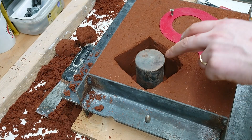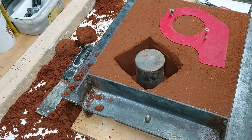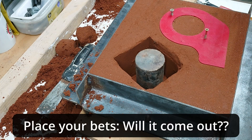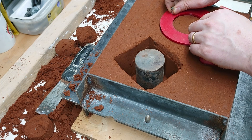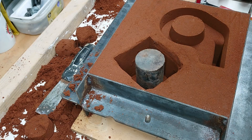I've decided to use this piece of pipe to form the core of the aluminium. This is stainless steel, and the aluminium may well stick to it, but I'm hoping that when it shrinks this will come away. If not, I'll just have to bore it out. I then pulled out the spindle — the mill spindle clamp — which came out quite cleanly, just a tiny bit of touching up needed.